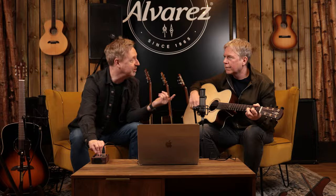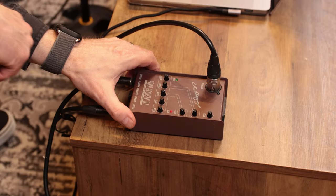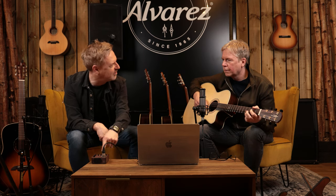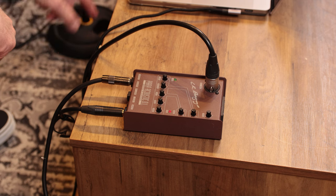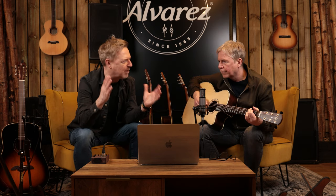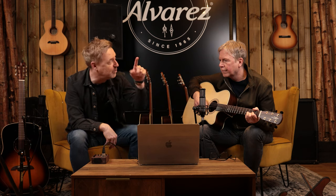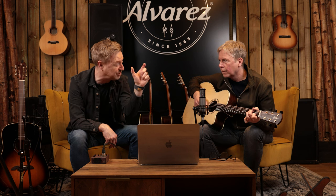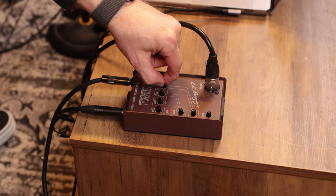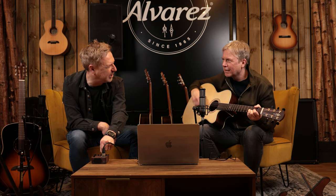Now, the other way of doing this, let's put it back in phase. This is the LR Baggs acoustic DI. It has some preset frequencies in here, and I think I looked on the pamphlet before, and this one where it says B is somewhere in that range I was talking about, 100 to 200-something hertz. Then we can notch it out, pull out the frequency just in that band. So if you strum again. That's right out. That's losing some body.